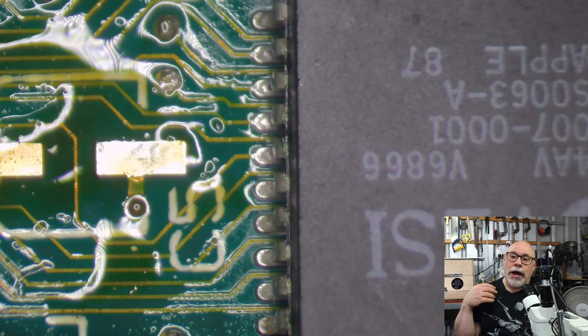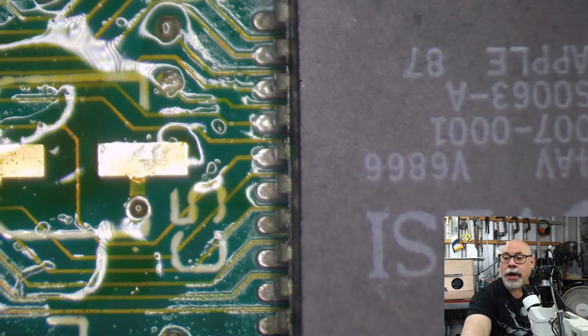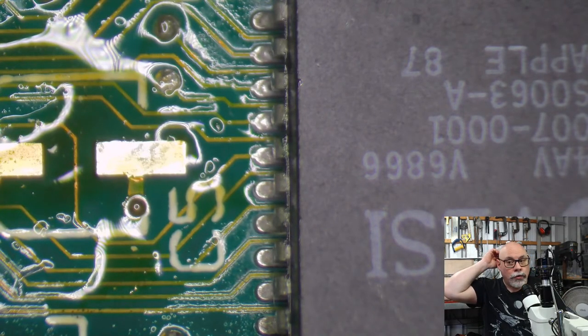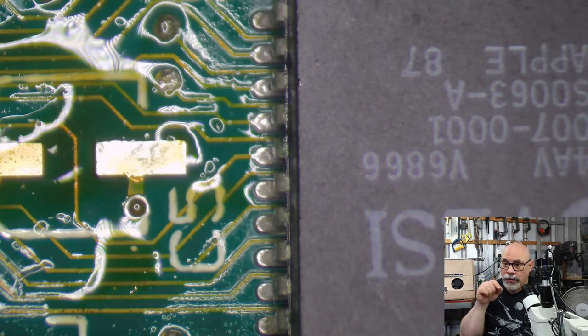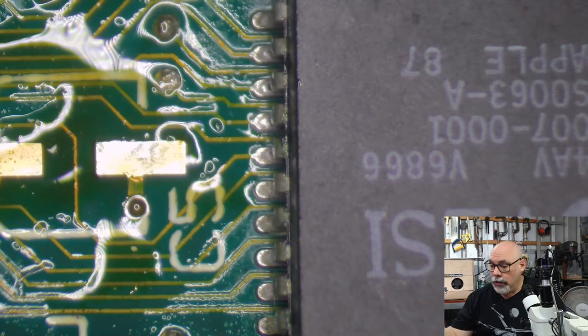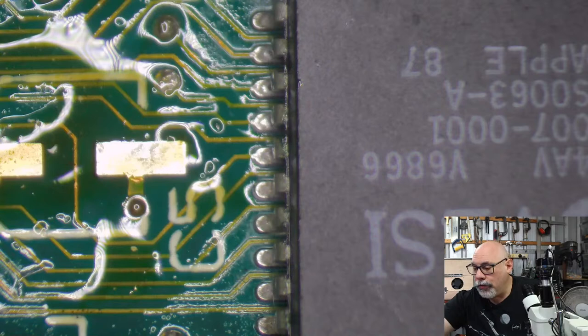So thankfully I was able to find them quite easily. They were on the ROMs. Because it worked beautifully when I used my Rominator, but it wouldn't work running off the original ROMs. So I found these little trace breaks, I fixed them up, got that 2SI working. So the 2SI and the power supply working, it's all great. Unfortunately, it was more than just a standard recapping, so a little bit more expensive for the customer. Sorry about that, but it happens.